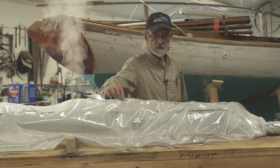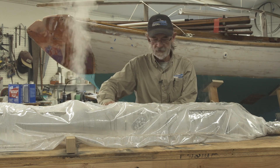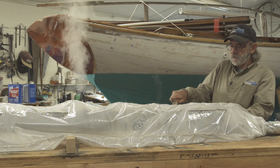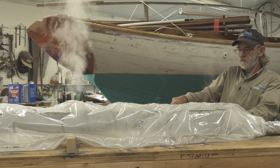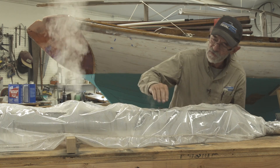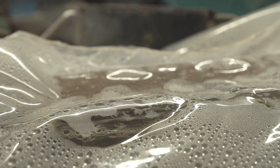We've got the bag inflated again and we're putting out a maximum amount of steam. I'm checking the cables here — they've already loosened up a little tiny bit and I'm going to crank it up a little bit more. Two clicks... two more clicks, and it's starting to bend very easily. Look at that nice curve in it. We'll just wait a few more minutes and I'll give it a few more clicks.